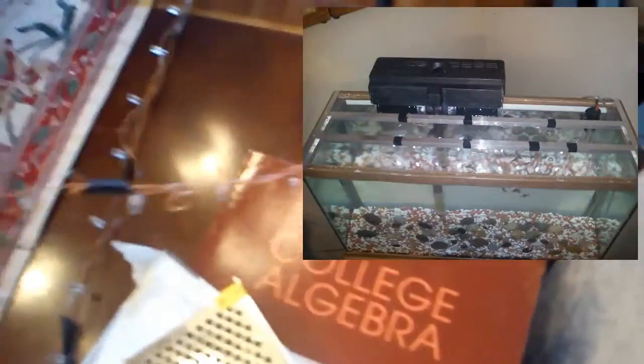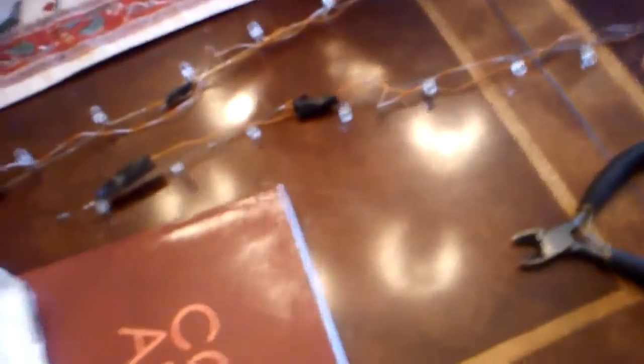I'm cycling in Tetras. This is the aluminum housing I made for the lights — I bought the aluminum, cut it myself, and riveted it together from a hardware store. These were the lights I was using prior: regular 5mm white LEDs in series of three with one 470-ohm resistor in series, three sets in parallel — six sets total across two bars — running off a 9-volt 2-amp wall wart.